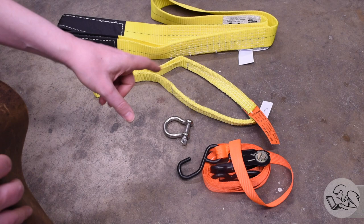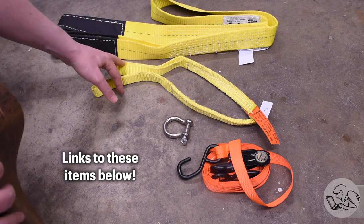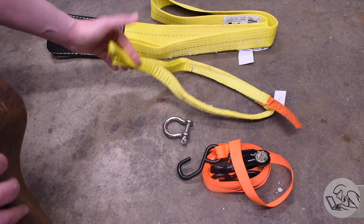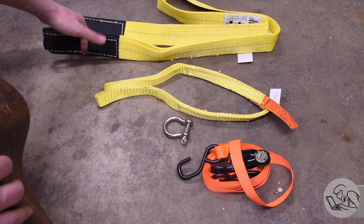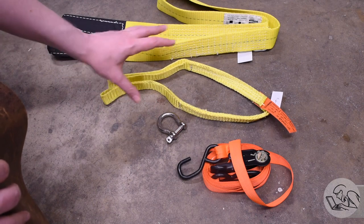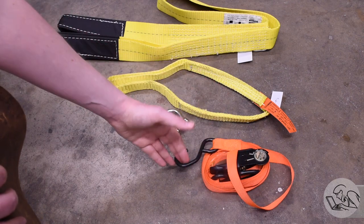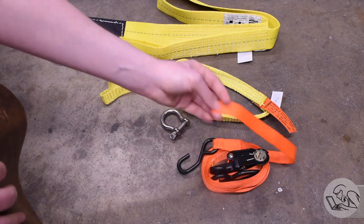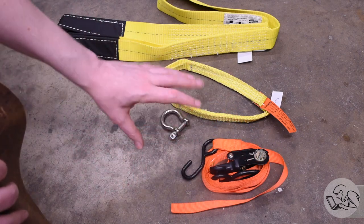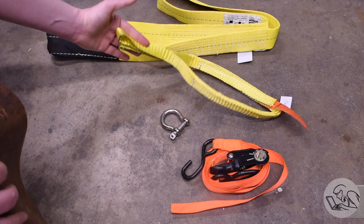When it comes time to lift that machine onto your bench, make sure you're using the right equipment for that job. You always want to lift machines with lifting slings — that's what they're designed for. They come in little sizes for little machines and big sizes for big machines. You want to use these with proper shackles. Don't ever tie knots in things — you're going to stress the straps in ways they aren't designed for. Don't ever use ratchet straps for lifting. That's not what these are designed for. You will break them. They'll tear easily, unexpectedly. You'll drop the machine on your foot. If you like your present number of feet and would like to keep them that way, make sure you're using proper lifting slings.